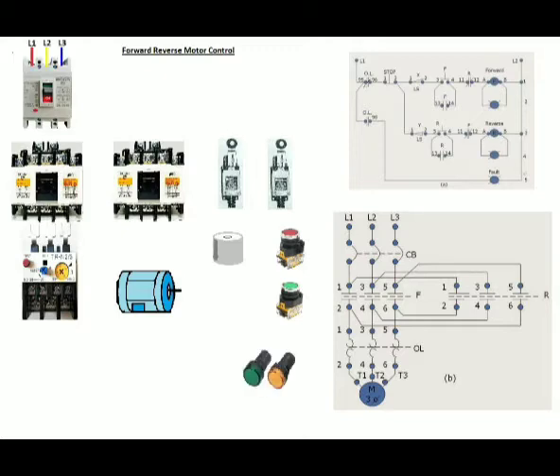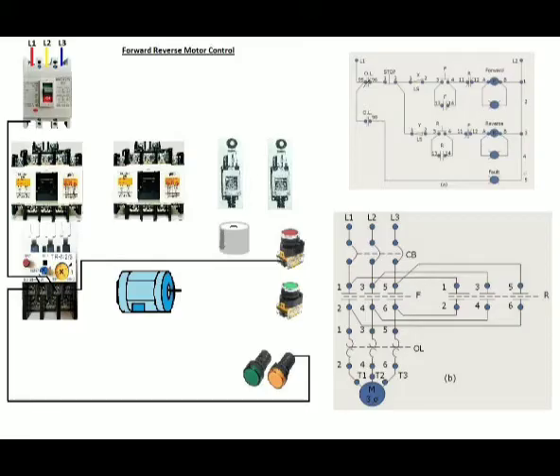Let us now go to the two portions of its schematic diagrams. In the power control diagram, the three-pole circuit breaker is connected between the voltage sources of line 1, line 2, line 3, and the magnetic contactor. In the control circuit diagram, next to the circuit breaker, the overload relay is connected by connecting line 1 to the normally closed contact of the overload relay in series with the stop push button. The normally open contact of the overload relay is connected in series from the load side of the circuit breaker to the fault pilot lamp.